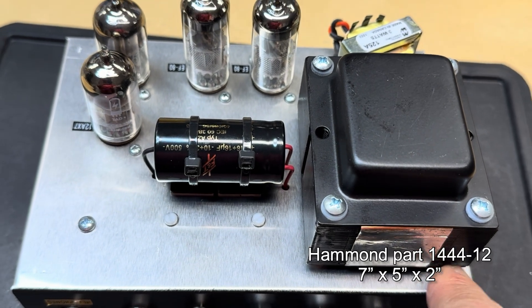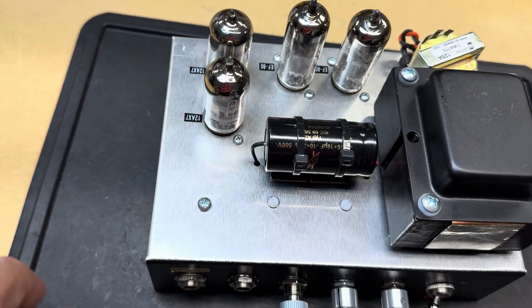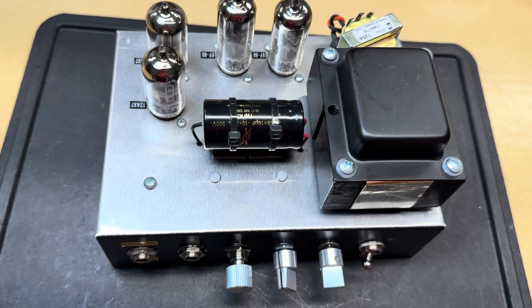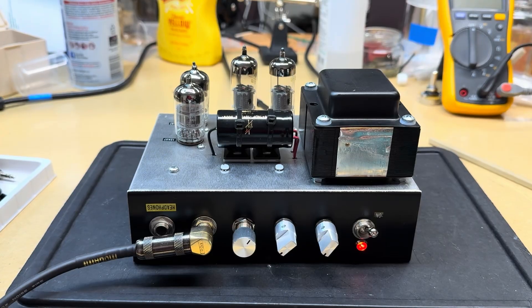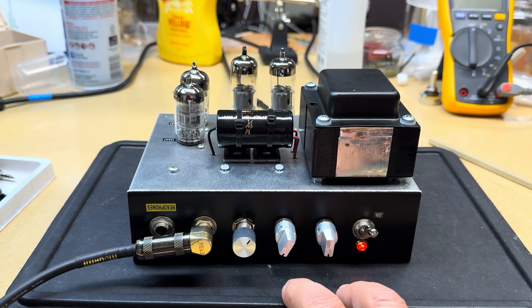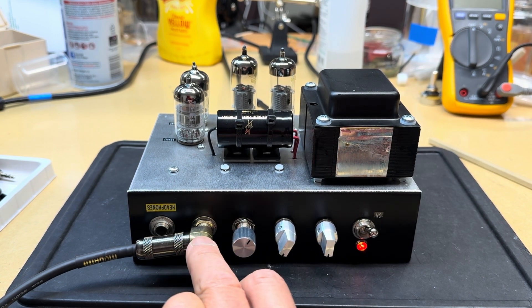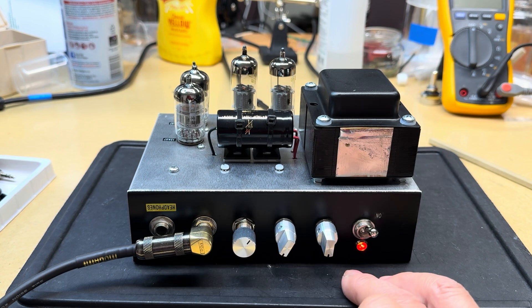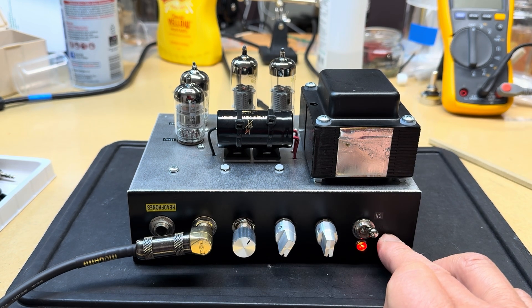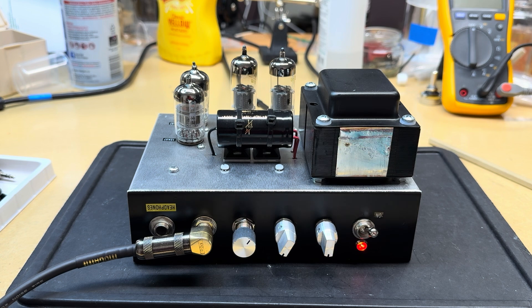The whole chassis is just a little Hammond project box — seven inches wide by five inches deep and two inches tall, so actually plenty of room to do the building. Here's the little fella all plugged in. There's not a whole lot of real estate to work with, so I just have really simple inputs — basically a volume and a tone — plus a headphone level output volume, guitar input, and headphone output. Stupidly I should have put the indicator light in a better spot, but oh well.